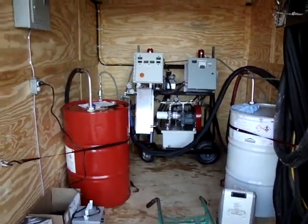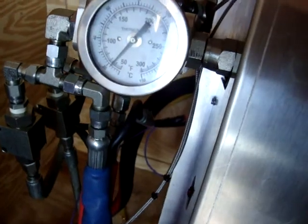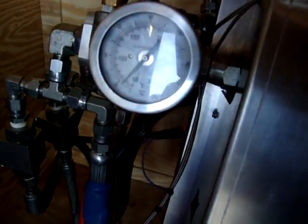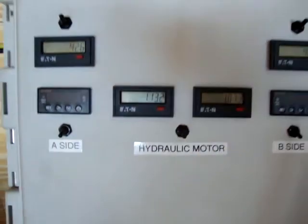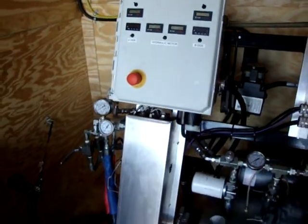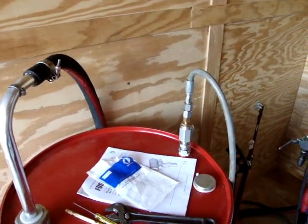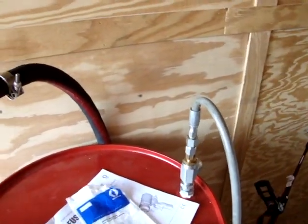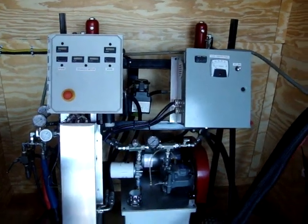The first thing I want to check this morning is a good look at this temperature gauge inside the trailer — we're probably 50 to 62 degrees. We're going to turn on these digital gauges in just a few minutes to see our temperatures, and we'll probably recirculate a little bit to get an accurate temperature of the material coming out of the drums. Notice the system does not have drum pumps, so we don't need a big compressor or refrigerated air dryer — the only thing air is running is the Graco Fusion gun. Here's your B-side resin and your A-side ISO.